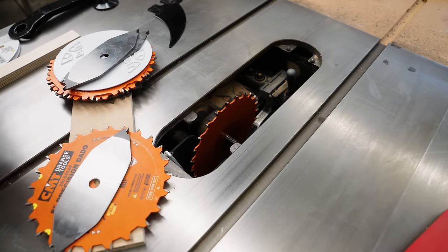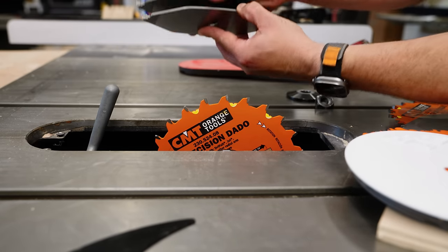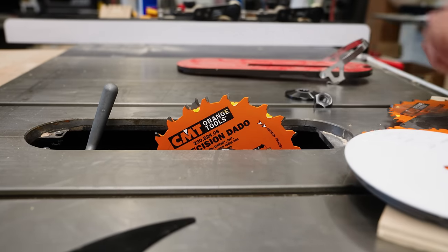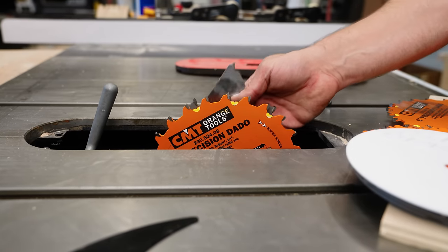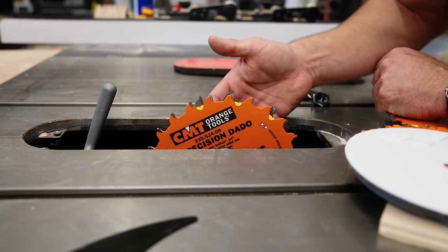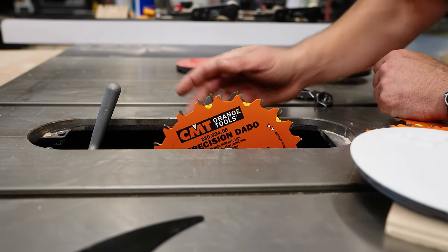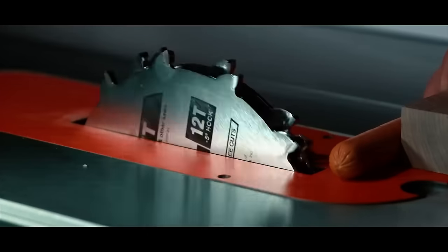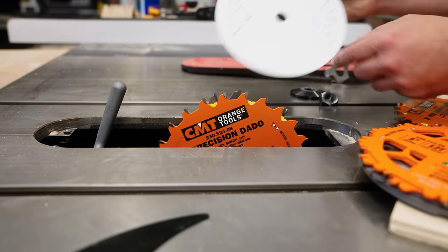Come around to the side and line up the chippers. You want to alternate the teeth so they're not lined up with each other. Make sure your inside chipper doesn't line up with the outer blade's teeth — you want the plates to be flat against each other and move freely. If a tooth is hung up on a gullet or hook and you tighten it down and turn it on, it could come loose. And if the teeth contact each other, carbide can actually shatter — it's very brittle. This dado stack is designed to prevent that rotation, making it a lot safer.